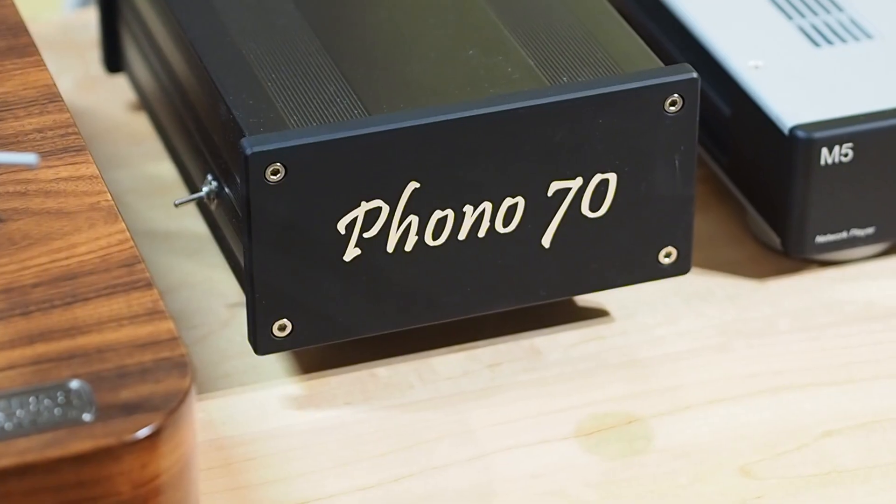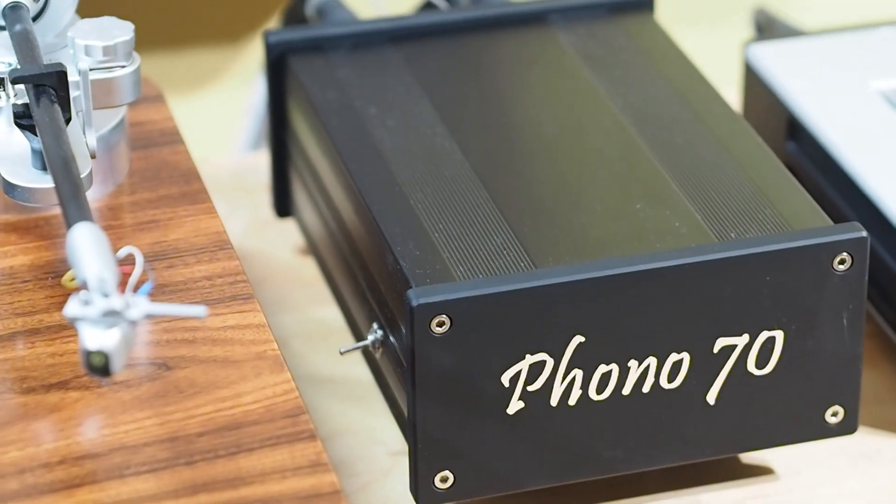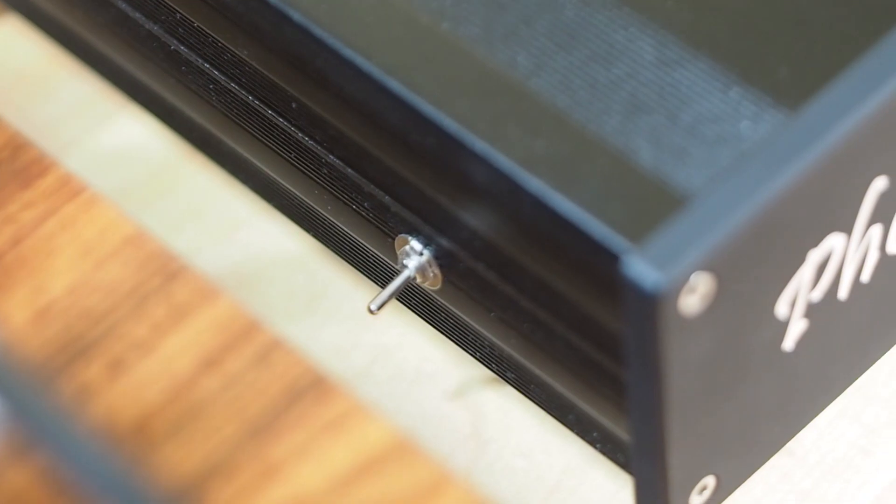After that we have the phono stage, which is a Paradox Pulse Phono 70. It has a couple of unique features that I asked for when I ordered it — I bought it new directly from Paradox Pulse. I had them put some rumble filters in it, because playing vinyl some warped records would try to make my woofers jump out of their boxes. They added a couple of switches on the sides of the enclosure — basically rumble filters, one for each channel.